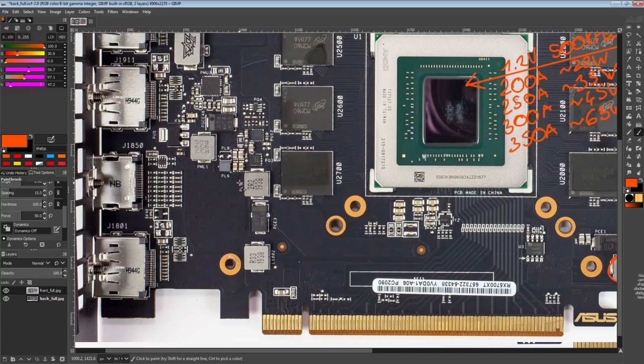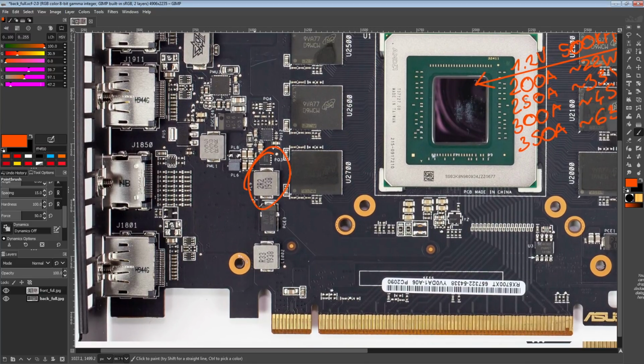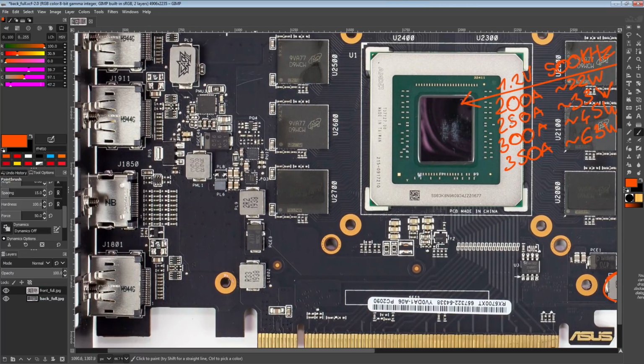And honestly, this looks really substantial. My understanding historically has been that 1.8 volts is primarily for the BIOS chips that the GPU uses. You use 1.8 volt BIOS chips on GPUs. They do go up to, I think, 1.8 to 2.5 or something. There's a voltage range on them, and normally you run them with 1.8 volts. But this is quite a bit more substantial than that. So I'm not sure, this probably actually powers something internal to the GPU as well. I'm just not sure what that would be.